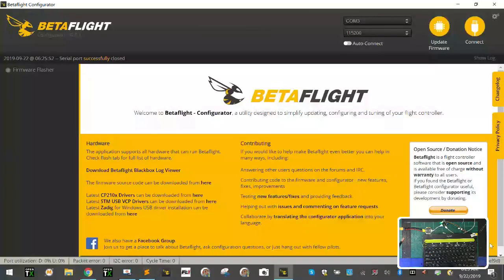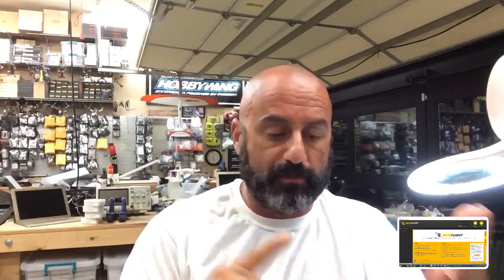Okay, now this is for people who are planning to use the other UARTs for other things. For example, the customer this video is for, the person that got a hold of me to ask for help on this, is going to be using a GPS, so they're going to need both their TX and RX, and they are using smart audio, so they're going to need their TX for that.